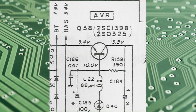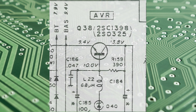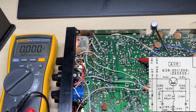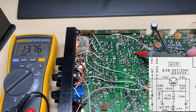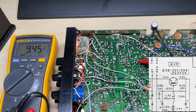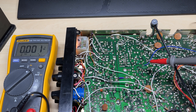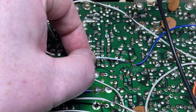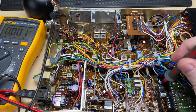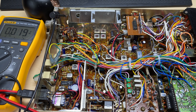Supposedly this gives clearer SSB audio. There's the AVR regulator we're going to be taking our voltage off. One side of the AVR regulator we've got 13V, then 10V, and 9.4V — so we need to be coming off the 9.4V. As this circuit draws a very tiny amount of current, it won't impact the radio at all. Feed wire is now in place. Let's check the board to make sure we're getting the regulated voltage — sure enough, exactly the same voltage as before.